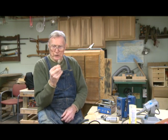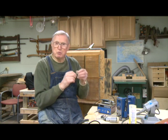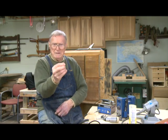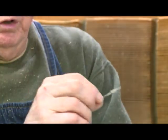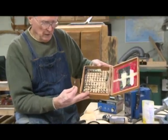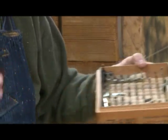When you get done with a Cutzall, you have something that's rough-shaped. Then you can move to a diamond cutter. This is one — it has small flakes of diamond embedded and will move the surface as smooth as if you were sanding it. I've got lots of different shapes and varieties, but you don't need any more than two or three. One that looks like a cylinder and one that looks like a teardrop will cover 98% of the carving that you do.